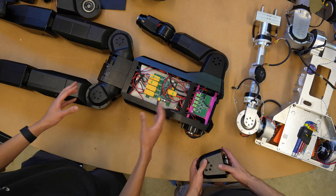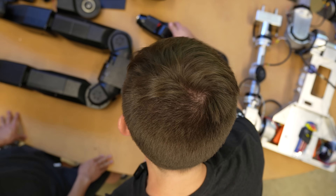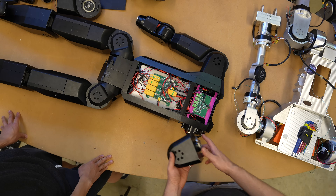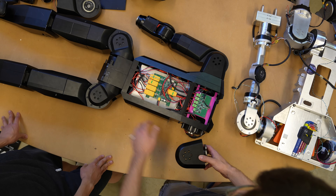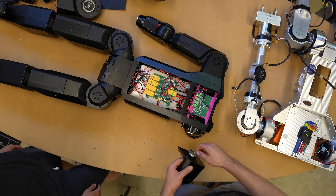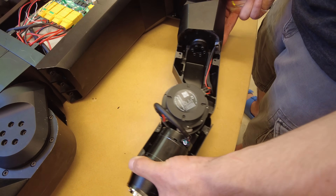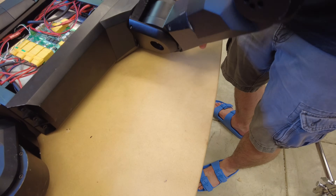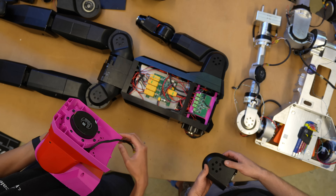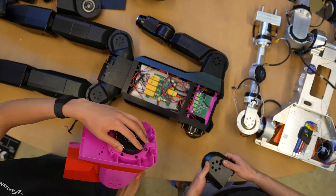As mentioned, a lot of the joint limits are implemented with the clamshell design, but some require a different solution. In the elbow and some parts of the legs, joints hard-stop on different extents of the external shell. For more complicated joints — the two-DOF in the shoulder and the three-DOF in the hip — we turn to actual separate tooth designs, ending up hard-stopping on different features. This allows us to really control where the motor is in its travel and make sure the joints' positions are understood by the reinforcement learning model. We also use 3D printing to validate the designs — wiring is one of the main things that's really tough to check in CAD, so we print them out and verify the wiring is good.